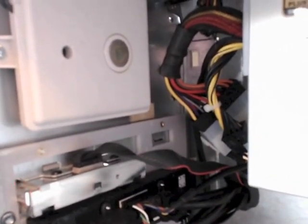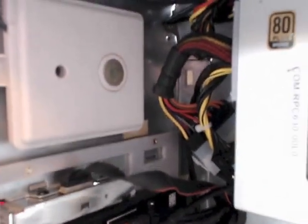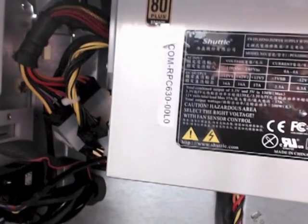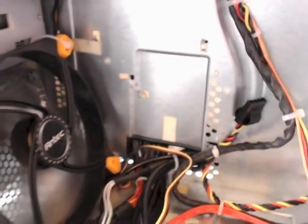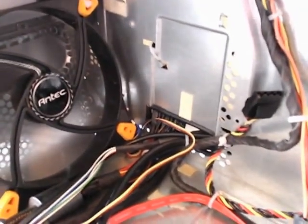Above that you can see the original power switch board. That's all been converted on the inside so you can reuse the original cable, which comes down here. I've routed the cables behind the other plastic panel on the other side so they disappear through a rubber grommet to protect all the cables. Similarly, the power supply has got all its cables running around the back, and the ones I'm not currently using are stored in the back part there.